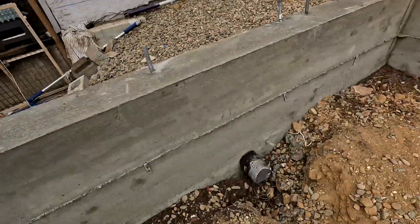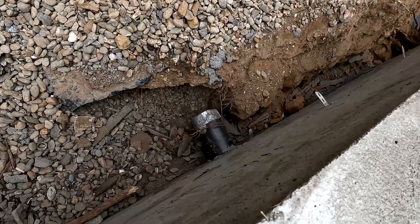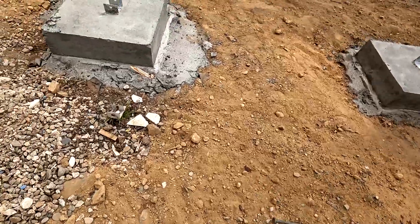Contact us for more details. Let's take you around the foundation and show you what it looks like after the concrete has been poured. We'll show you the sleeves we talked about earlier — the sleeves for water connections and sewer connections. We'll also show you the posts in the middle of the foundation. This particular project required six posts in the middle. Here is one of the sleeves — this is where our sewer connection will go in the future. The sleeve goes through the foundation and allows the sewer pipe to pass through when we put it in. And here are the six posts we talked about.